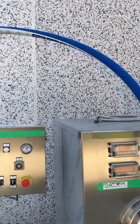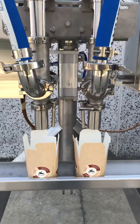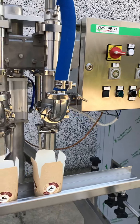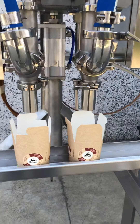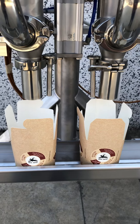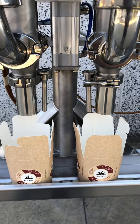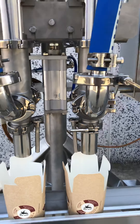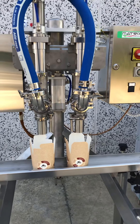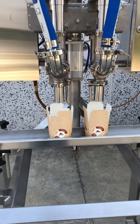At the end, the mix is sent to the filling machine. This is a semi-automatic doser pack filling machine, very easy to adjust and very flexible, suitable to fill containers from minimum 50 ml up to big containers of 5 liters. The unit can be connected with the ripple pump to inject ice cream with ripple sauces. Very easy, very flexible.